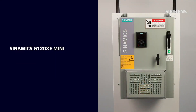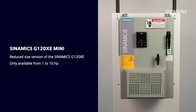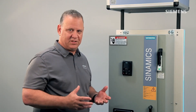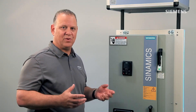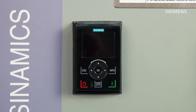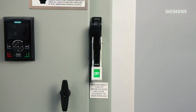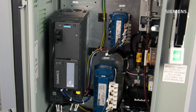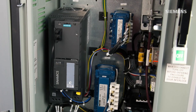An alternative option is the G120XE Mini, a reduced-sized version of the G120XE available only from 1 to 10 horsepower. With the standard G120XE enclosure, there is room for most standard options, but if very few options are purchased, that larger enclosure is not needed. The G120XE Mini was created to give customers the benefits and functionality of the original model while saving valuable space. The Mini still has a door-mounted IOP-2 and a main circuit breaker, and standard options can be added, but larger options like bypass or input contactors will not fit in the Mini model.